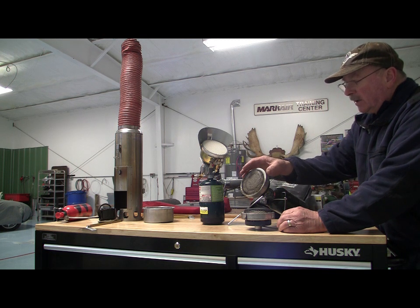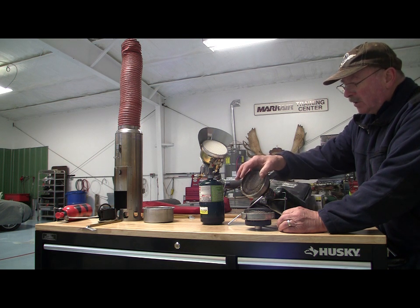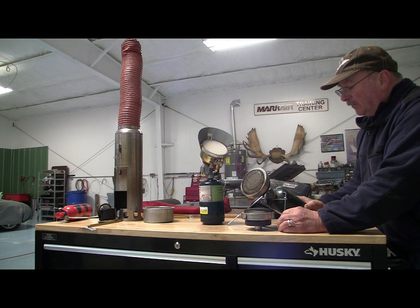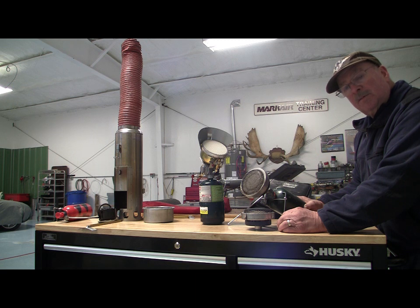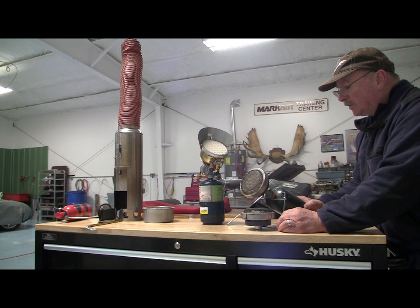It's a catalytic heater, so you need a warm propane bottle and this unit warm. You get the catalytic heater started, then you set this down through your oil door in the engine, and this will last for about 7-8 hours. So if you finish flying in the early evening, late afternoon, a couple hours later you put this under the cowling, this will keep the engine somewhat warm through the night for you, where at 20 below, you should still have 40 degrees of oil temp and be able to start your engine. So this is good for keeping the engine warm.